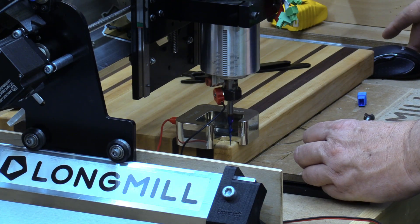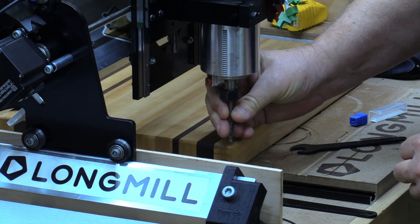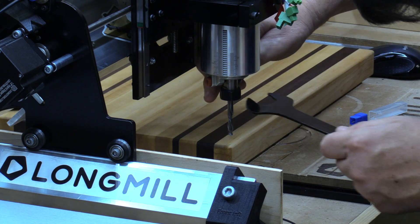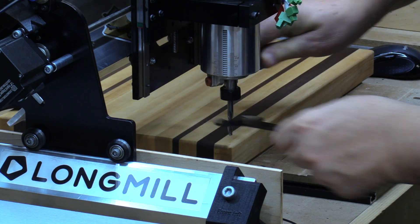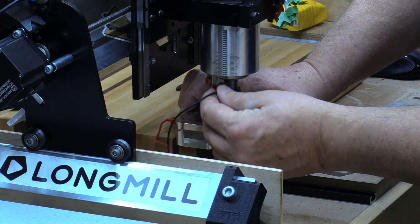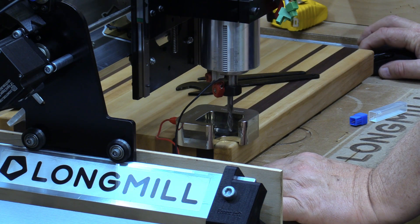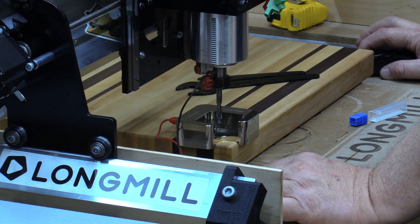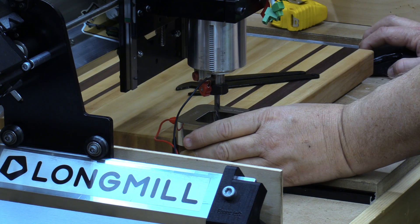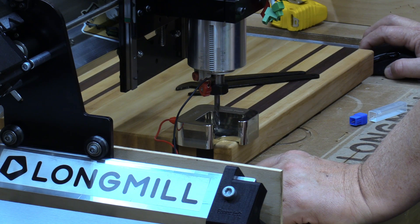This time I'm not going to touch it — I'm just going to let it do its thing. How crazy is that? That is crazy good. On the money. Here is a flat end mill. Touch probe back in, magnet on, keep the wire up, and let's raise it up a little bit and bring it back in. I want to get it down a little closer — we're going to do an X, Y.